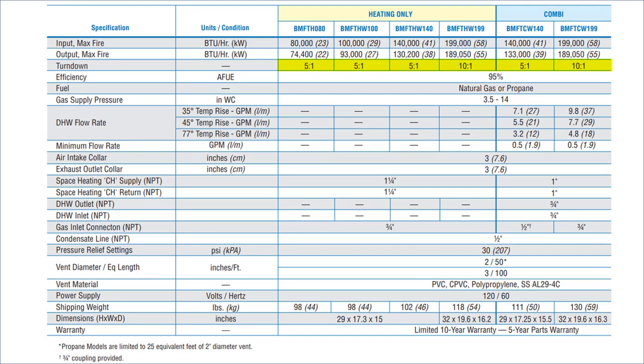It's 95% efficiency across all boilers, whether straight heat or combi. The turndown ratio gives you flexibility across the BTU range. For example, if a building needs 80,000 BTU but on a mild day only 20,000 BTU is required, the boiler can turn down to 16,000 BTU — floating just above its lowest point of turndown and saving money through economy of operation. Essentially, it almost right-sizes itself for that application. Another great benefit of the Brute FT.